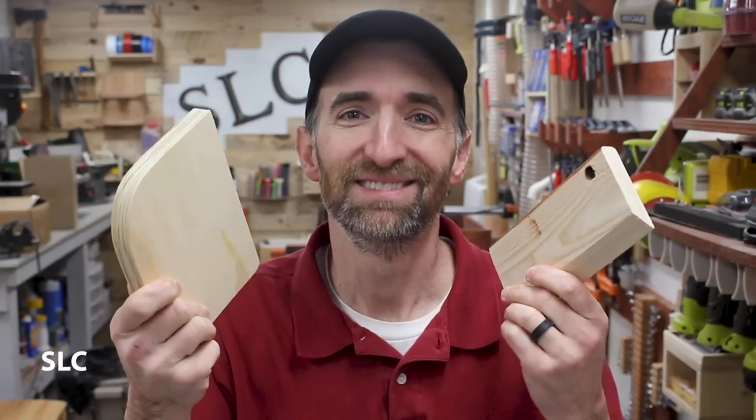So solid wood or plywood? That is up to you. Now, is it possible to attach French cleats to a concrete wall? Yes and no. Most concrete block walls are hollow inside, so screws won't be very strong, and concrete handles pressure from the top well but is not nearly as strong when you drill in and pull from the side. To avoid issues, you need to build a 2x4 frame with 16-inch center supports that attaches securely to the floor and to the joists above. Once you do that, you can add a wall and then add your French cleats.